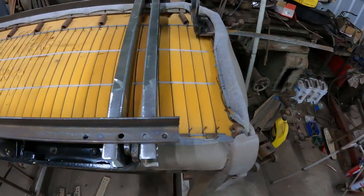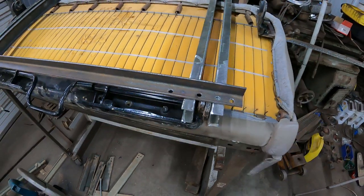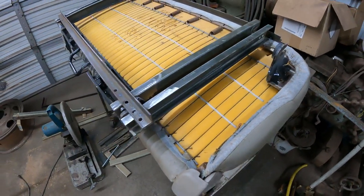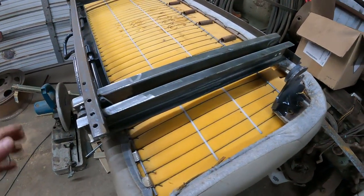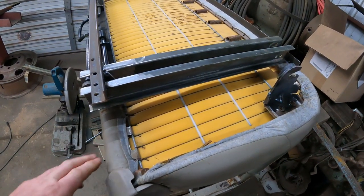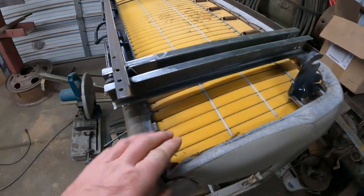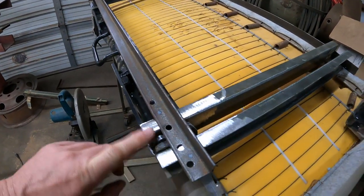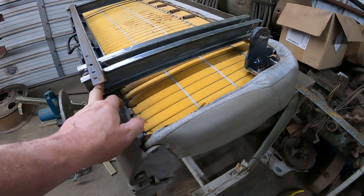I came up with the idea to use the original locks from the Suburban. So this is a Suburban third seat that I used on my other Ride, and I was pretty happy with it. So I had to run around the junkyards to find another seat. The last one I bolted in and made a bracket that welded to the seat. This time I want to approach it a little differently, so that I can remove the seat. So I'll use these two to center this hook mechanism. We'll be putting a bolt through where this can grab.